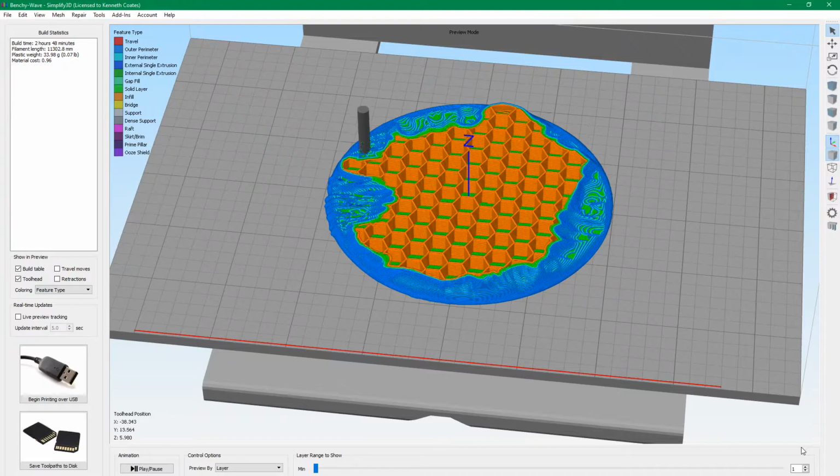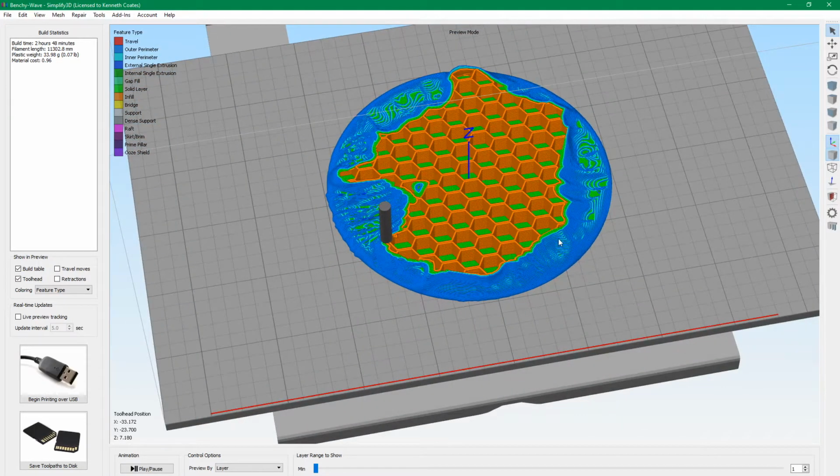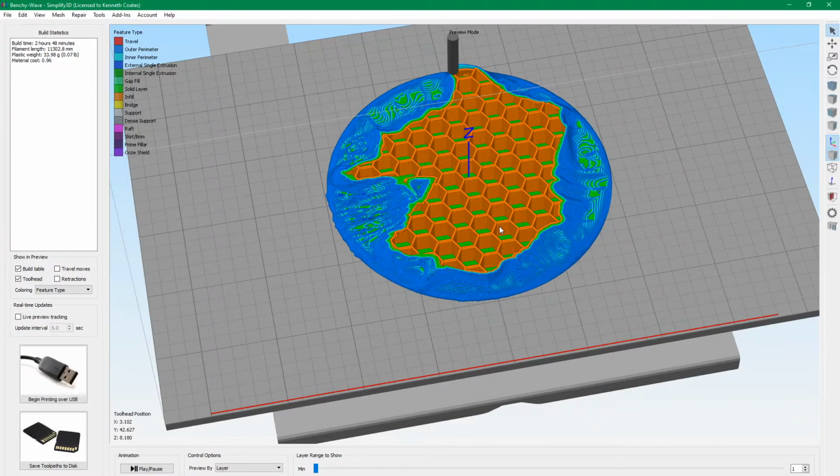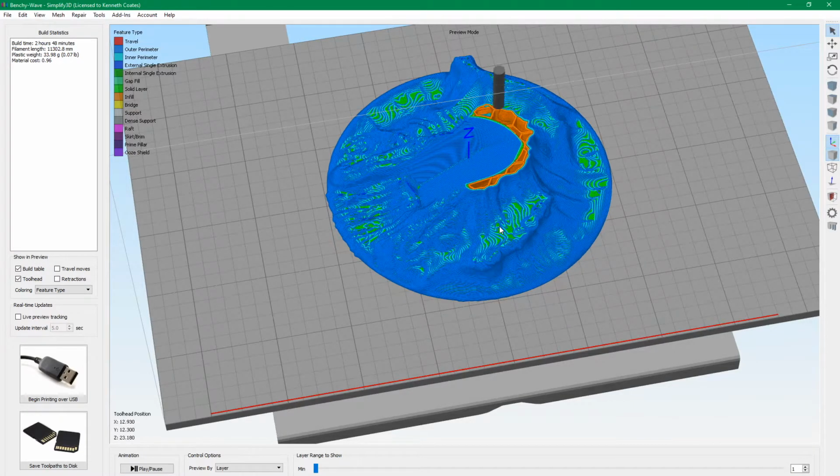See the fast honeycomb printing because it keeps going in from the outside, and the fast honeycomb I think gives a better support for what it's trying to do here. So we'll see. Hopefully that'll work out. And we're printing at only 20% infill because it's just a test print and it'll go faster and really we'll end up wasting less filament. So, all right, see how that turns out, and then we'll show it with one of the Benchies I printed as a little finale.